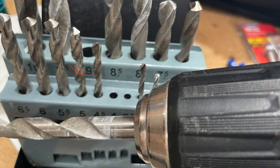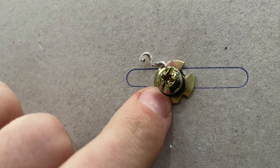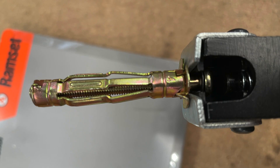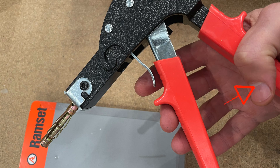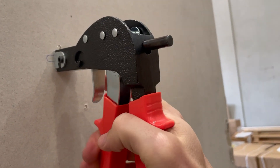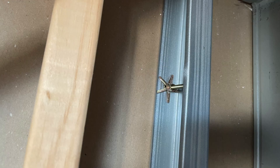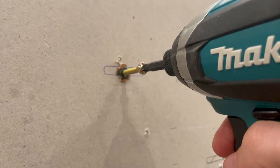You just drill a hole — it said use a 9mm drill bit. I'm not only a terrible installer but also terribly impatient, so I used a 10mm bit. You insert the hollow wall anchor into the hole, leave a gap between the head of the M5 screw and the wall. The tool has a slot in the end; as you squeeze the handle it forces the screw backwards and the legs spread out. It doesn't seem to matter if you squeeze it too much — remember, foolproof. When you're done, hit the trigger. The first attempt looked a bit dodgy but it worked. I then tried it into the metal stud and it was fine.